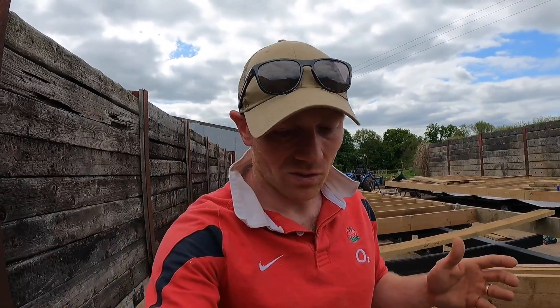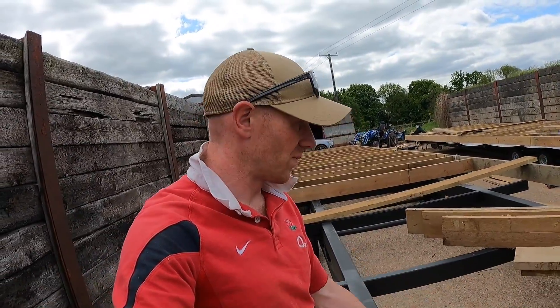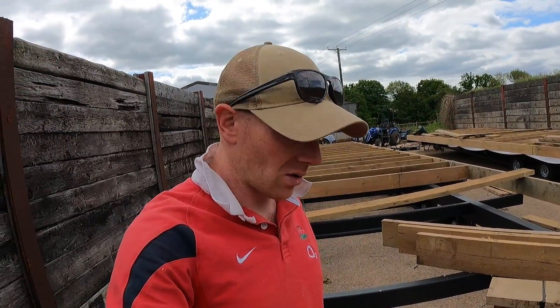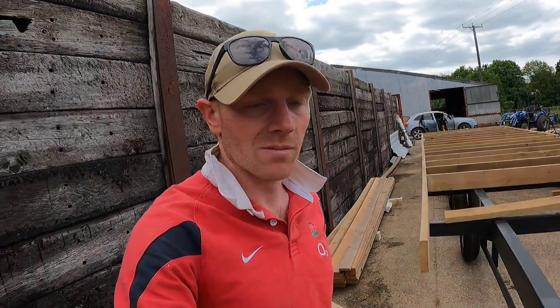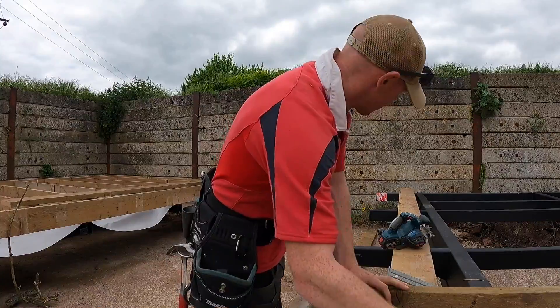So one, you don't want your own livestock or pets eating the stuff. But two, if you just had exposed Kingspan underneath, it's still not a deterrent — there's still a way through. So the only way to make a suspended floor or this type of cabin rodent proof from underneath would be a mesh. We were looking at six mil galvanised mesh over all of them, but the cost benefit wasn't there. I'm sure there's a retrofit option — if we had to, we could probably come in with wire from underneath. But hopefully that's wood — yeah, that's wood — so we won't need it.